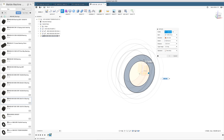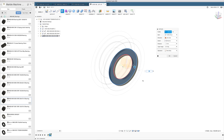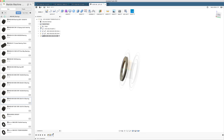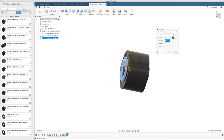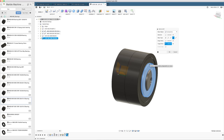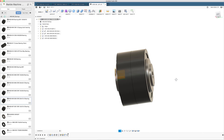This is our spacer block. It's going to be 2 millimeter thick, so I'm making an extrusion of 2 millimeter and hitting OK. And we want two of them. And here you can see the point-to-point command is so lovely. I choose this ring, I choose this ring, and it's exactly in place.